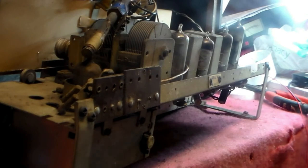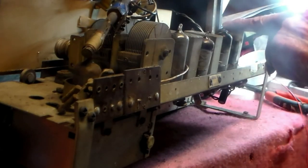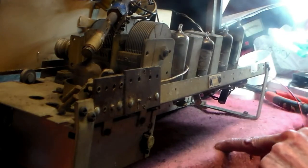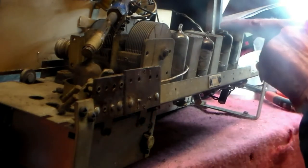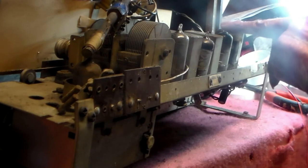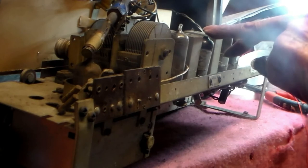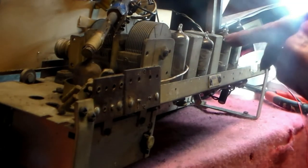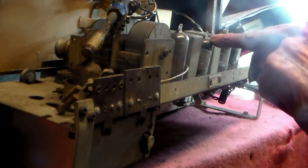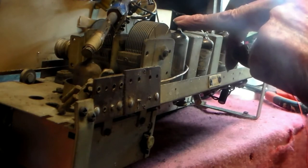Next along, on VHF sets, it'll be an E or a U ABC80. A is one diode for AM, B is two diodes for FM, and C is the first AF amp, all in that valve. UF89, crackled a bit. That is the IF amplifier valve. This is on AM, the mixer oscillator valve.